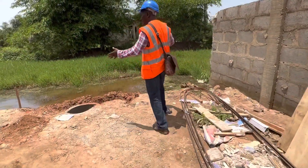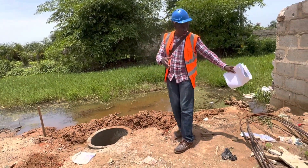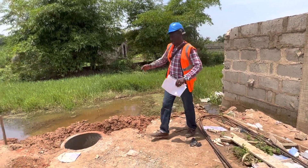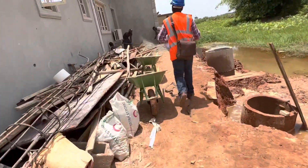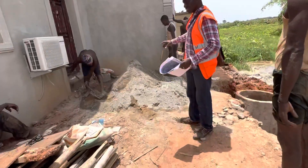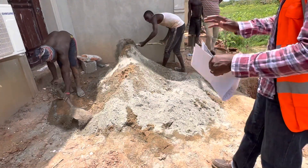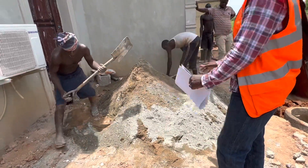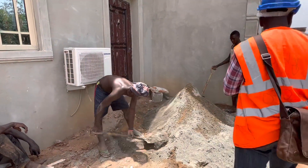The cabinet is going to hold. After the concrete has been poured, we will now put another beam across it with iron rods. Now they are mixing the granite — they are mixing them together. They will be bringing the granite to mix with it. This is the fourth stage: they will first mix cement with the sharp sand, and once all of it is mixed together and in the same texture and same mix, they will now be pouring granite on it, then pouring water on it, and then pouring it straight into the ring.